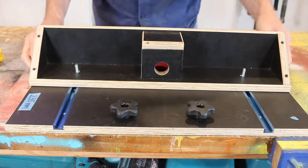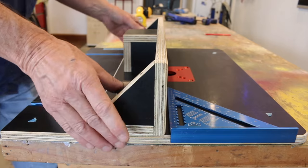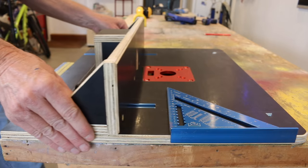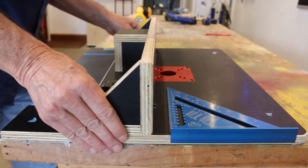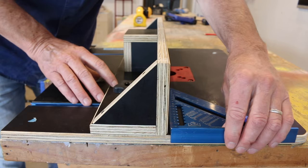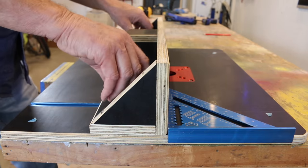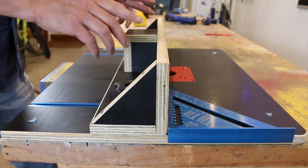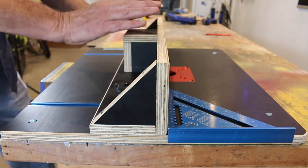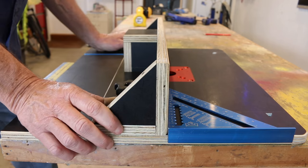So that's it folks — we've made ourselves a very nice little sliding router table fence and it works an absolute treat. All you need to do is square the fence up with your square, tighten down those locking nuts and you're good to go. The next thing we need to do is just screw that box together, then we'll attach the router and give it a crack to see how it goes.